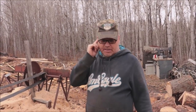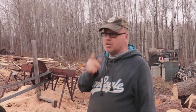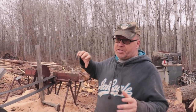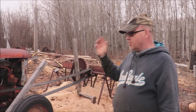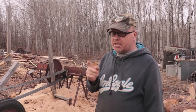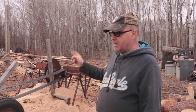Hello folks, how are you today? I wanted to clear up one thing about the buzzsaw. I know a lot of people don't know this, maybe some do. Somebody is saying they used to put a half twist in their belt when working on the farm. They said that kept the belt tight and keeps it from coming off. Actually, if you put a twist in the belt it'll drive the blade backwards — you can't do that.